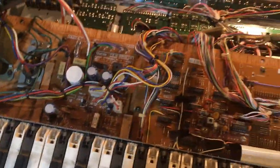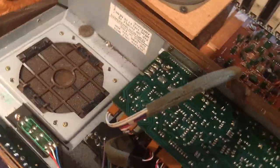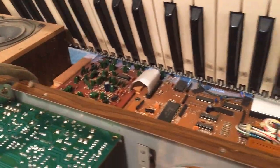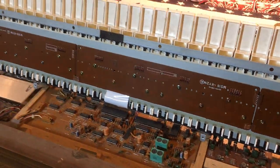So I first looked to see where the switches were on the circuit board and if it was possible to change them, which it's not, and it's not worth it anyway for me to try. So I went ahead and tested my theory to see if I could turn on the unit with the 470 ohm resistor. When I say turn on, I mean start the music playing or the drum beat starts. Those are the two switches that were worn out.